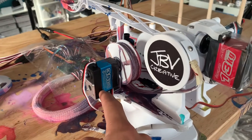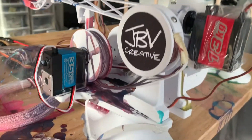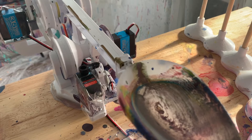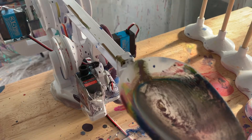The first parameter is fling strength. Using this servo motor, Flingbot can load these elastics at different forces to achieve different power levels. By randomly choosing an angle between 90 and 180, this parameter can be varied. Once the elastics are charged up, this motor releases the arm, allowing Flingbot to fling.